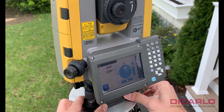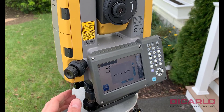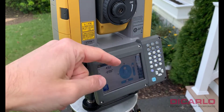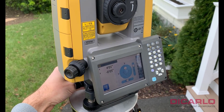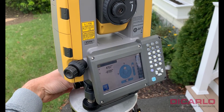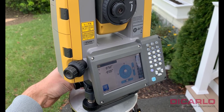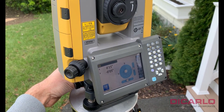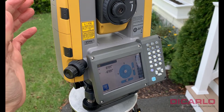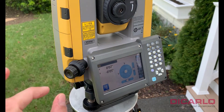Getting close — just a little adjustment, that overshot slightly, but it's good enough. Now that we've figured out placement in one axis, we focus on the second bubble using the left hand again. The bubble needs to go that way, so I turn the opposite screw — the one closer to me — watching the numbers turn down. If I'm within 30 seconds, that's usually okay. And that's it — I'm finished with the leveling of the instrument.